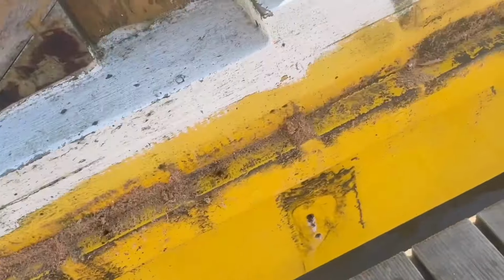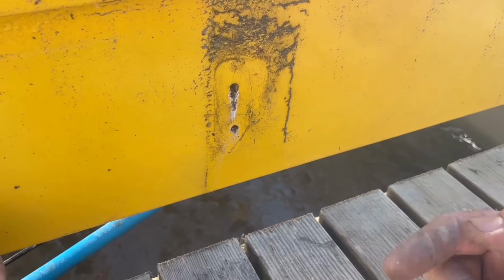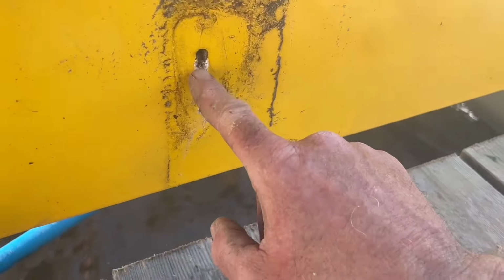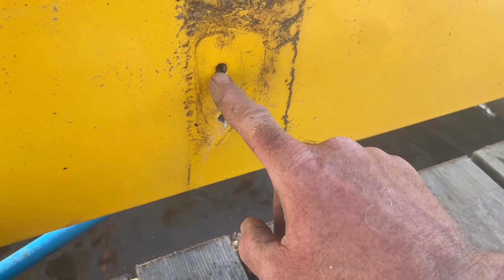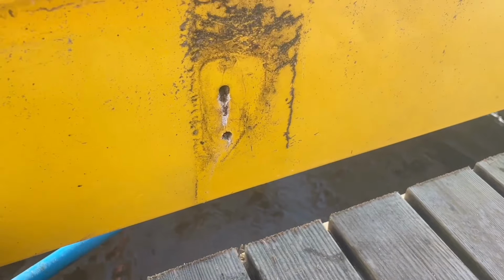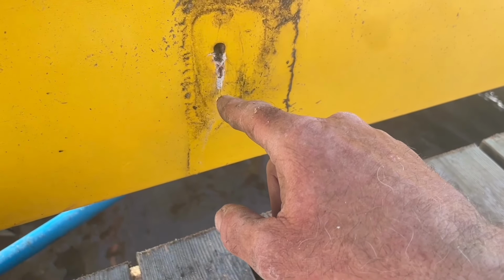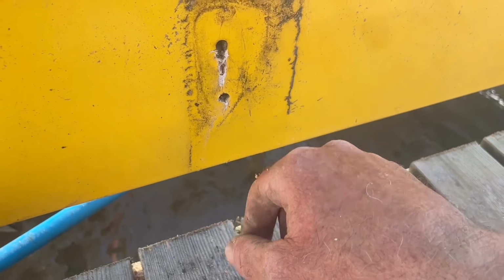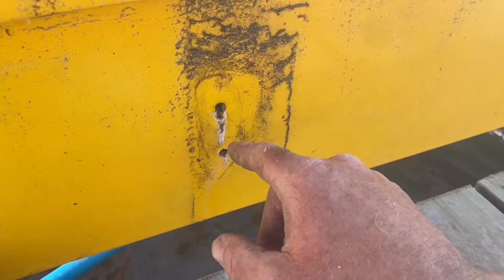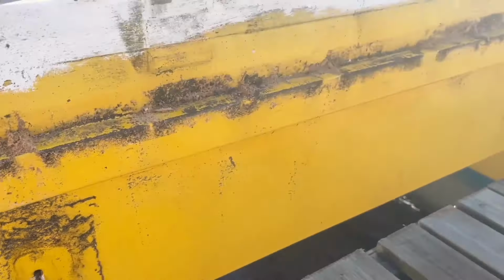And also, when this was built, the framework that I took out that was underneath the deck held the engine. And this is where there were coach bolts going in. And it's not rotten, but I wouldn't say it's a great solution, because this is all fiberglass, but that's just created penetration for potential water, which undoubtedly has happened. So I'm going to have a look at that, maybe sand it back and just see what it looks like and then fill it. Hopefully it'll be okay.